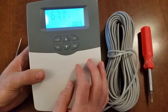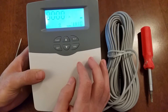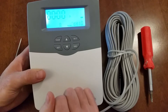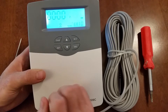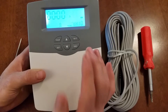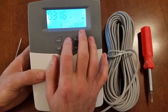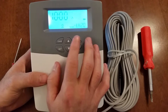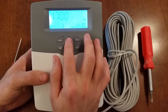What you're going to use more often is the timed heating — this is what you'd use under normal operation. You get into the timed heat function just by tapping set once, not holding it down, as that's the main function. And there are three timed heating settings. You can see timed heating one, and the zero indicates the start time. Then you have timed heating one F, which is the final time. We also have timed heating two start, timed heating two final, timed heating three start, and timed heating three final.